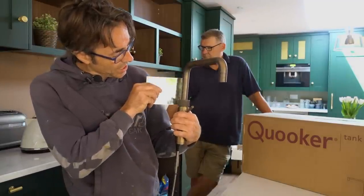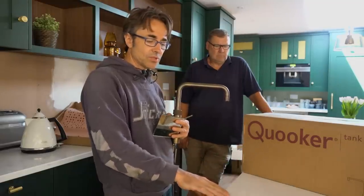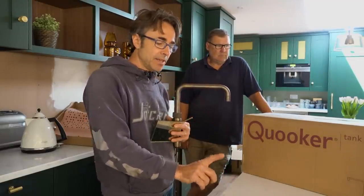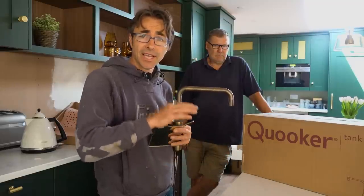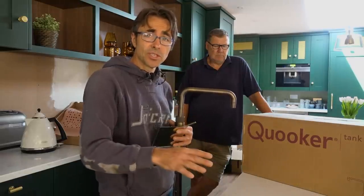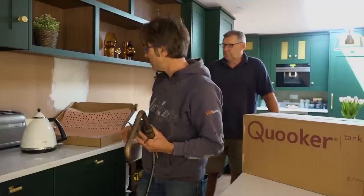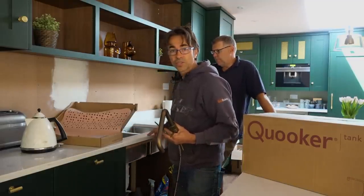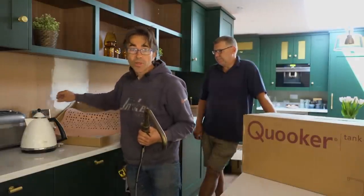I think they're just going to work really really well together. We've also gone for a quartz which looks a little bit like Carrara marble — it's quite on trend at the moment. The reason we didn't use Carrara marble is if you spill wine or oil on it and haven't cleaned it out, or it's not sealed properly, you've had it. Also it's particularly soft — if you've got a section across the sink it's got to be reinforced underneath because it could crack.